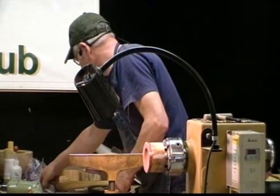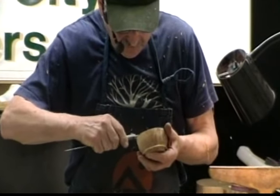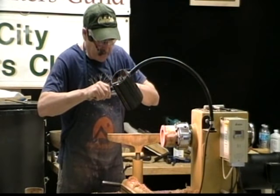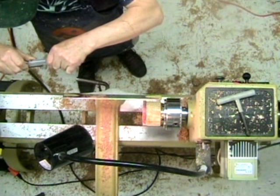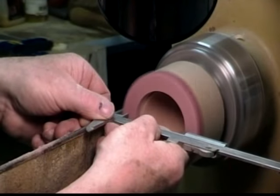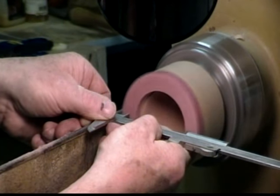Now, you take the calipers and just measure the internal diameter of the inside of the lid and then widen it out. So at the moment it says 78 millimeters, okay? So we'll go a little bit extra. We'll go out to about 79 millimeters. And we'll mark a ring on this, starting out in the waist, keep going in till both pointers are in the same groove.